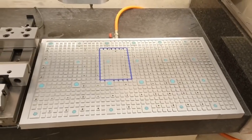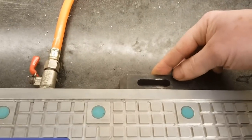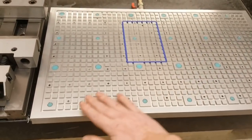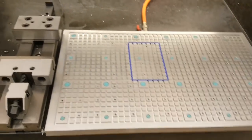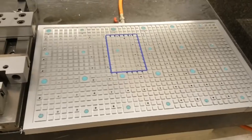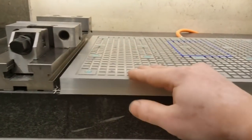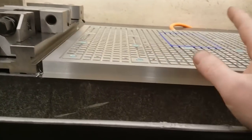My first operation was to put it on the granite plate and lock it with clamps, but not in a traditional way — I put the clamps like that and bolted them to my inserts in the table. The reason was because all of the plates which come from the manufacturer are wavy, with a bow one way and another way. So the reason for not clamping traditionally was not to deform it during milling, and if I had clamped it, I couldn't face the whole surface.